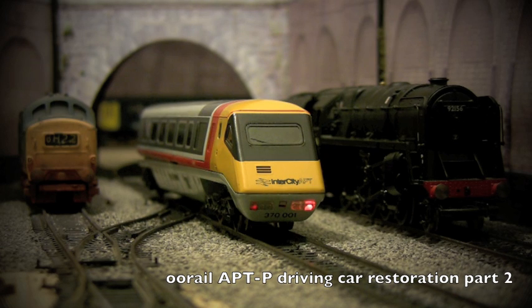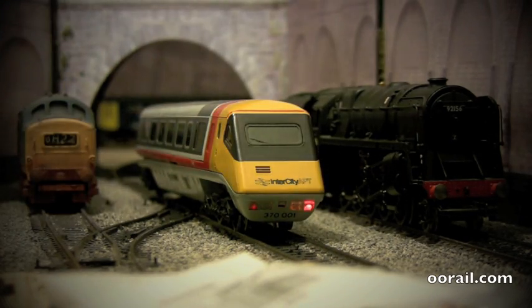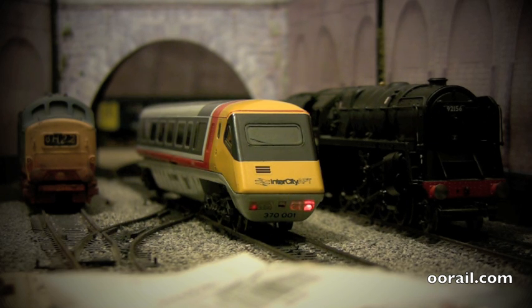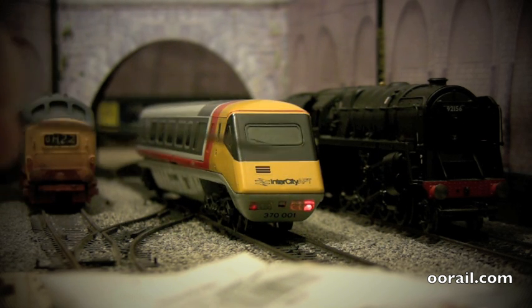Next I'll walk you through the changes we made — it's really not that difficult. You need some basic electrical tape, some kind of knife (I used a Swiss Army knife), a soldering iron, a 220 ohm resistor, and two square LEDs. For wire, I used 22 gauge wire — though I'd suggest using slightly thinner wire like 24 gauge. Basically you need to cut a couple of strips, strip it down on either side, tin it, and then remove all the wiring from the original APT.